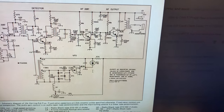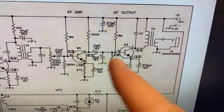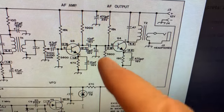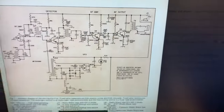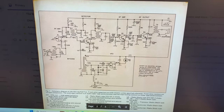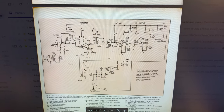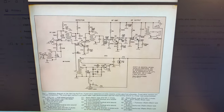But anyway, I want to take a look at another problem this morning, and that is this capacitor. These are the audio amplifiers, Q3 and Q4. A 10 microfarad cap carries the audio across, but look at that — why do they have that 10 microfarad cap right there to ground? That'll really kill audio performance. I suspected that was a mistake. In the receiver that I built back in 2014, I just clipped that thing out. As soon as I cut that lead on the capacitor, the receiver sprang to life — it was no longer deaf, and it was great. So that was my first indication that something was wrong here.